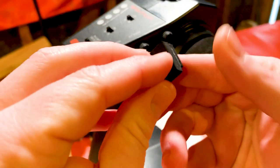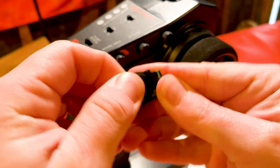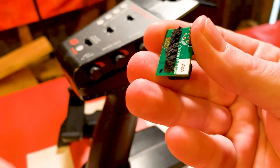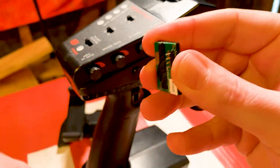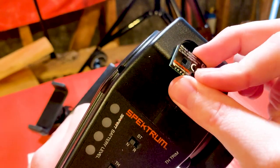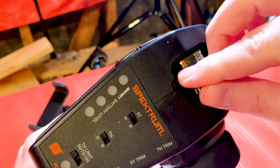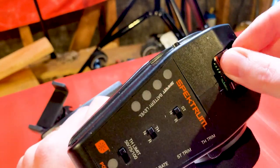You've got the little port there. Go ahead and peel off the rubber padding — it's only for shipping. Then look into this port and you'll see those four pin holes. Take the BT2000, do your best to line up the four holes with the four pins, and push it in.